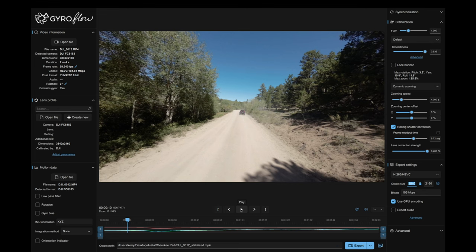But before you get to this point, before you hit record on the drone, there's two settings that you have to change. First off, using the goggles, you go to your camera settings and you have to set the field of view to wide — step one. Next, you need to go to the stabilization settings and turn off stabilization. You do not want Rocksteady, you do not want horizon level, you just want those turned off.